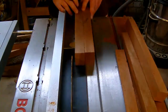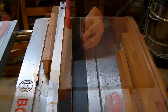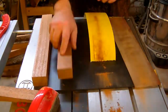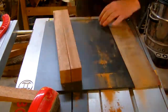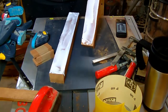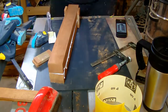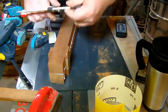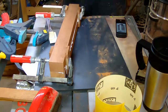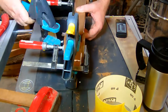For the bottom piece, I squared two of the raw blocks for the later glue joint. With some 80 grit sandpaper on a flat surface, I managed to flatten the glue faces. Now it's just a matter of adding some glue and some clamping pressure to get the, well, more heavy base of the final frame.